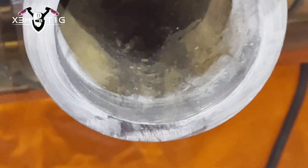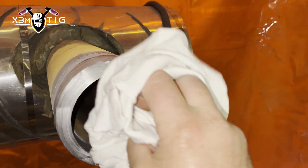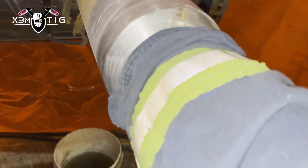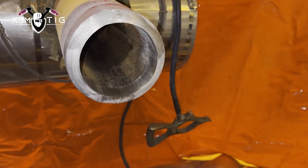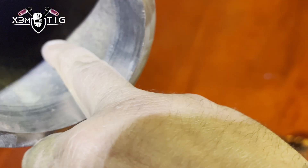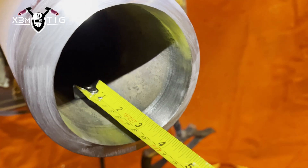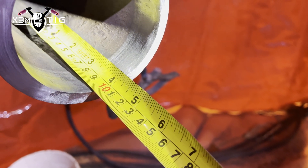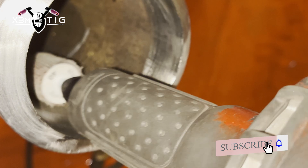The material is P22, so we're gonna clean this now. Once you get rid of all that rough stuff, make sure everything is nice and clean before you start any prep to build your dam. We've got to build four dams - it's gonna be a needle purge since we can't run a hose and purge the entire line because it's a big line. My rule of thumb is four inches from the edge - that's where I'm gonna put them.